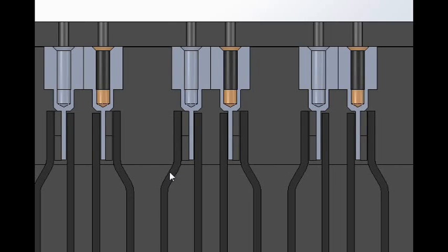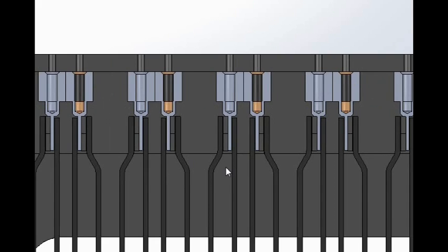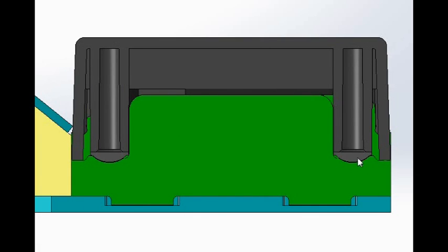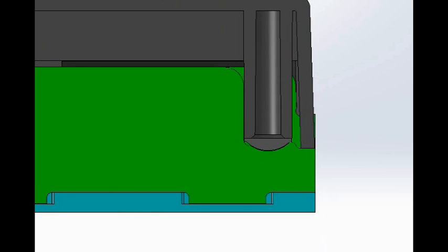So we're very directly getting to the heat on the actual film side. On the other side, we're taking the heat that's conducted through the pins from the solder joint, through the pins, and then through the high conductivity epoxy into the heat sink. So we're getting both sides, and of course the aluminum is carrying the heat out to where we can get to it. This is one of the advantages of solid modeling — the ability to get cross sections that fit exactly where the piece will hit the part, and design it so I can still do it with a 1/16th end mill and have everything cut through the whole shape without any other machining necessary.